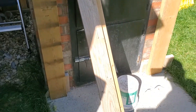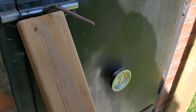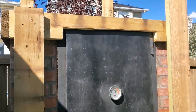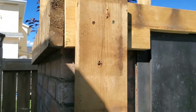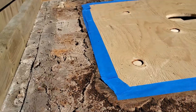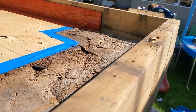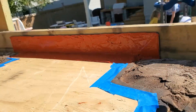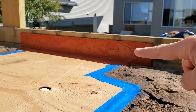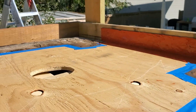The forms are pretty much done. I was using one bar propping up the door frame while I removed the tarp straps, but I no longer need it. I then used 2x6s all the way around, attaching and bracing them on the ground. I've got this form here, and I'm going to have to put in that quarter-inch skinny board and cut it to match what the angle iron is doing there, because otherwise we've got a gap down there.